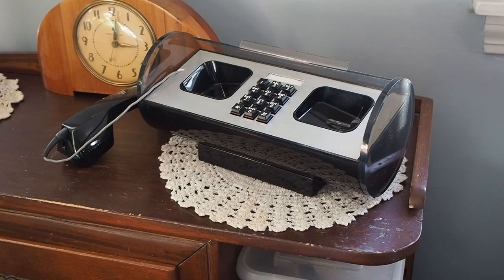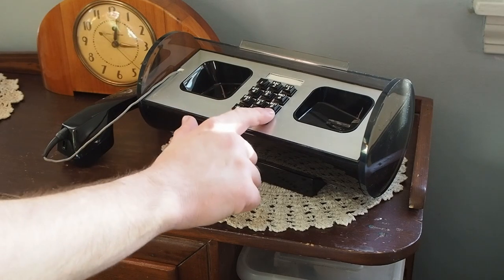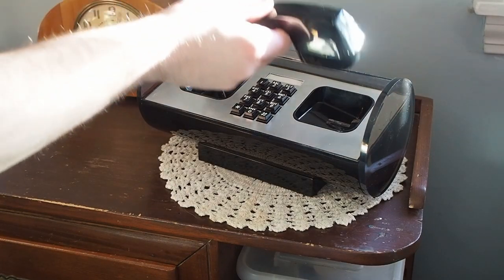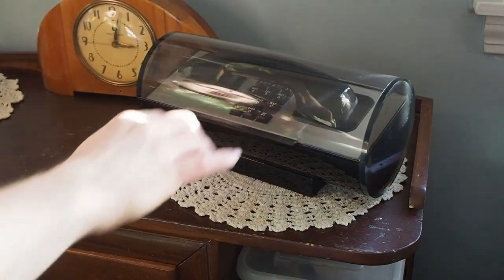So on the remote access, we can do all the same stuff we can do using the local telephone access. However, the only one we cannot do is a panic alarm. Remember it was star pound? It doesn't do anything. When we're done using remote access, all we need to do is just hang up. Just like that. And we're done.